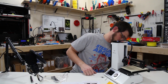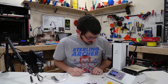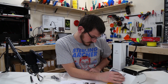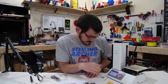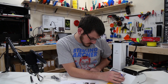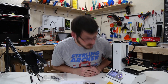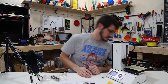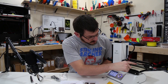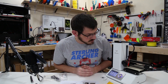Now we can power it on. Look at that — works really quickly. Ensure the power switch to the rear is on. Rotate the control wheel clockwise, move to the Move entry, click, rotate the wheel clockwise and highlight Home Axis. And it's homing the XY and now the Z. Then we're probably going to have to adjust the bed. Oh, they use a belt tensioner in here — a lot of kits come with belt tensioners but everyone says not to use them. I'll have to see what people say about this one.